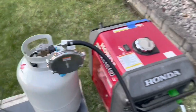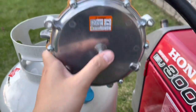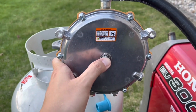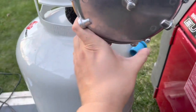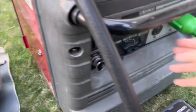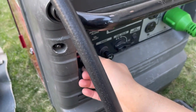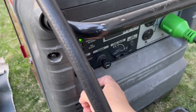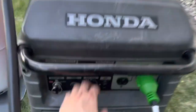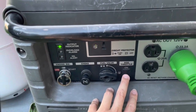We're going to go ahead and turn this generator on. Make sure the valve is open here. Sometimes you got to tilt the demand regulator up. You hear that hiss. Put this boot cap underneath it. Make sure eco mode is off, everything is okay. Nice, starts up great. Let's check how she idles — low idle. Very nice.